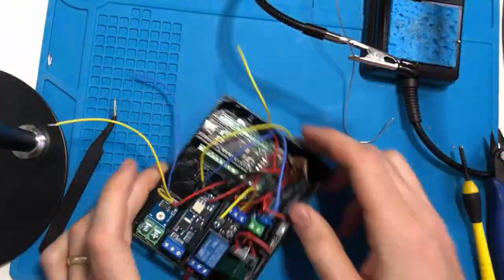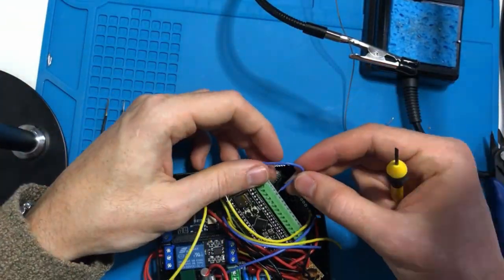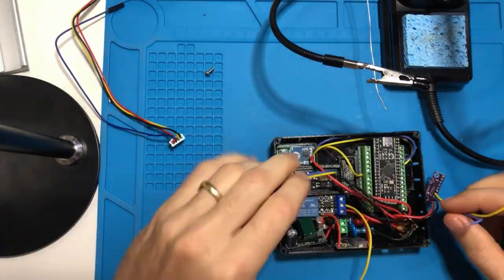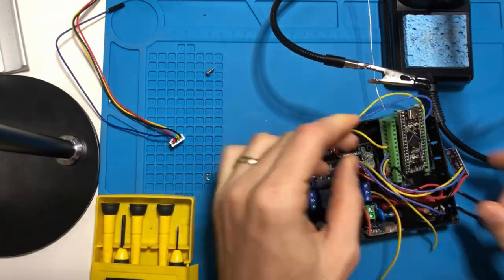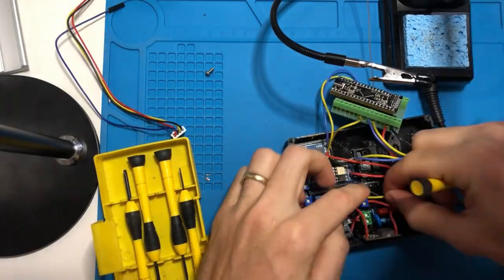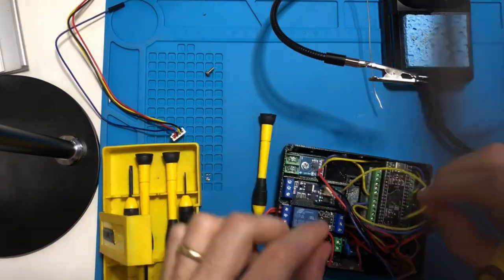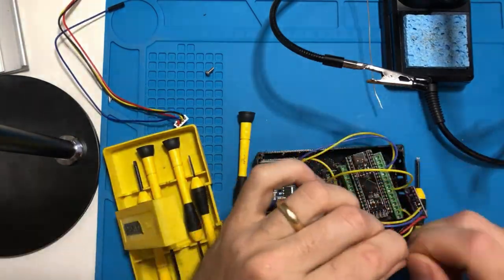One of the things I learned through this process was that you really only need 26 gauge wire between each of the components within the housing, because it's all going to be low voltage, no high voltage is carried in between the components and the housing. And the 22 gauge wires, which I used to be more conservative, had a really hard time fitting through the holes in the components. So when I switched to 26 gauge for the signal wire, it made the whole process a lot easier.